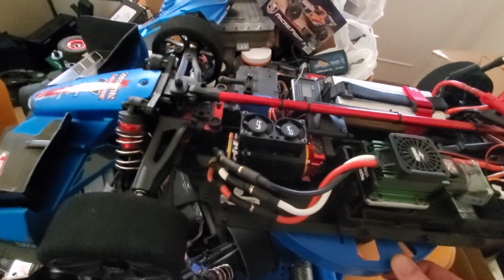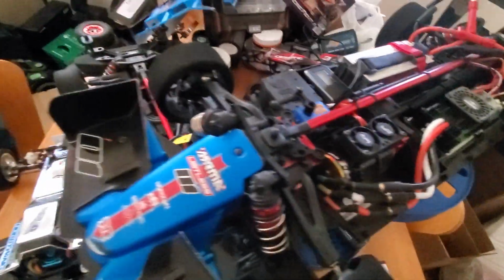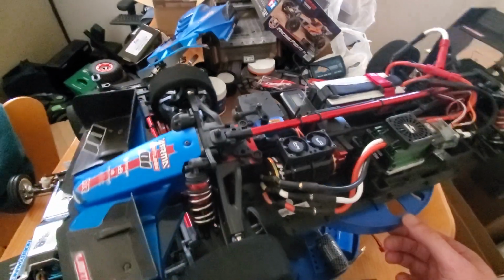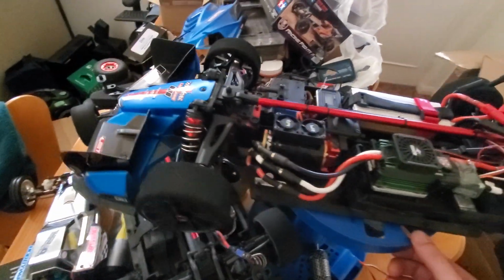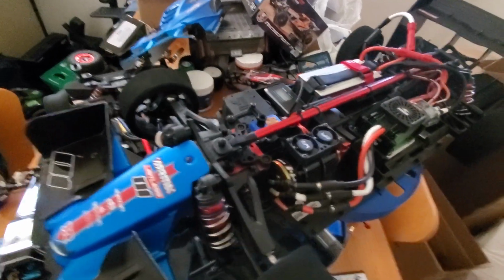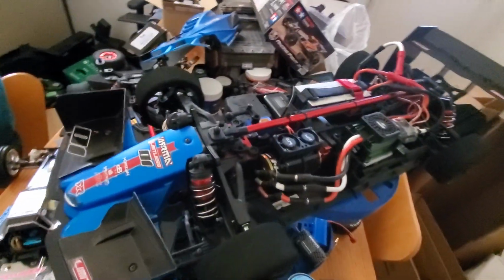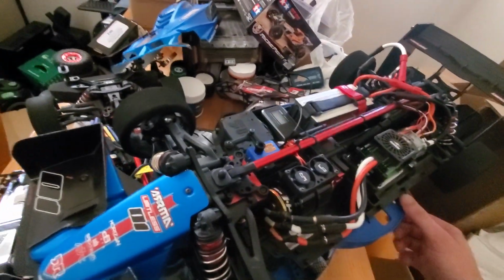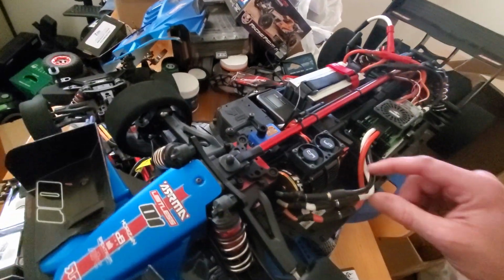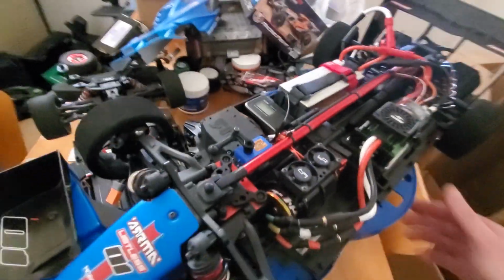Anyway, I started putting this thing together. I couldn't be bothered doing the whole switch-around flip motor thing, and there was a bit of theory behind my build here. Some things I've read over the internet the past few months, just some basic tips I've picked up from RC building, is you want to keep battery wires as short as possible, and have good big high current terminals to prevent resistance where possible.